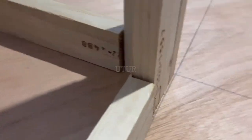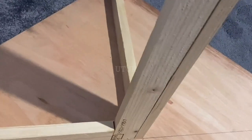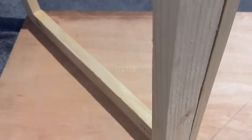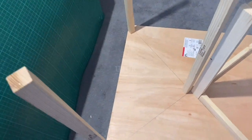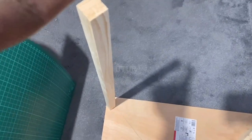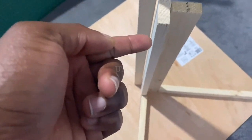The pine wood has a thickness of one inch or 1.4 inches depending on which housing structure you're looking at. Using a thicker screw or one with a larger diameter could result in splitting the pine wood. So we're looking for a thin screw — I've selected 60mm in length and 4mm in diameter screws, equating to about 2.375 inches in length. This screw is fit for purpose as it has a sawtooth that prevents splitting; it's quite thin and will go through the pine wood without splitting.